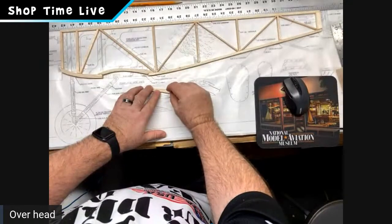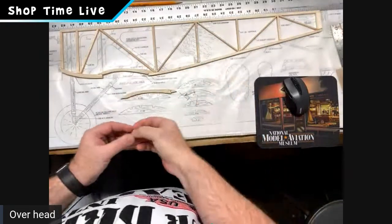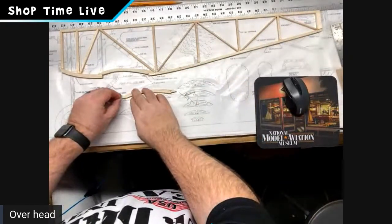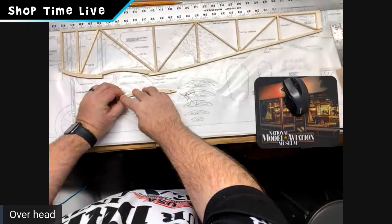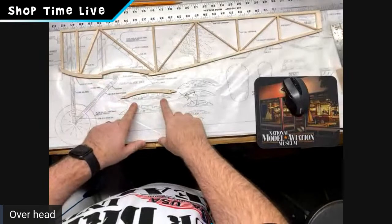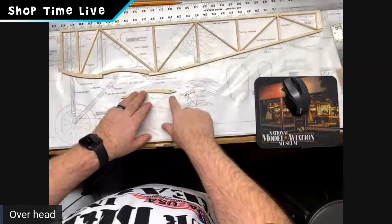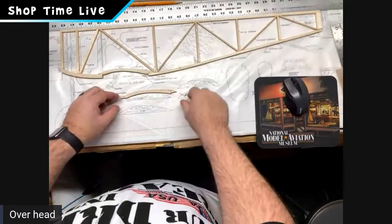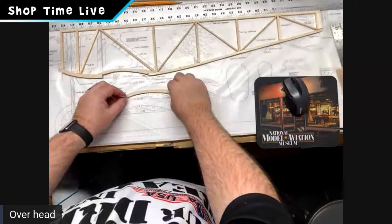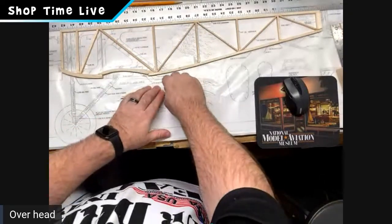when you put these down on your board, if you put a pin right in the notch on each part, so there's a notch on that end and there's a notch on this end, when you bring your laminations together, like Ronnie is doing, you actually have it lined up already so that when you put your pieces down, you don't have to worry about sanding too much around your notches. With these smaller parts, it worked just fine the way that we showed you, but that's just another method of doing that.